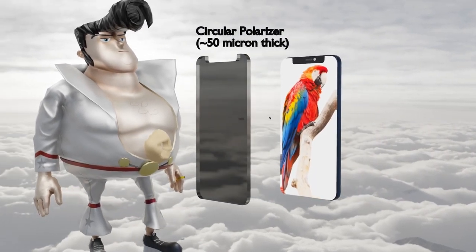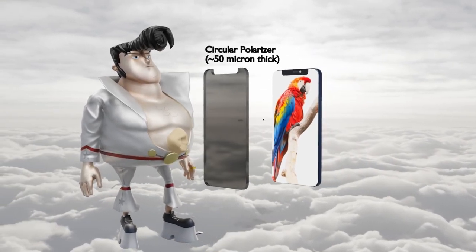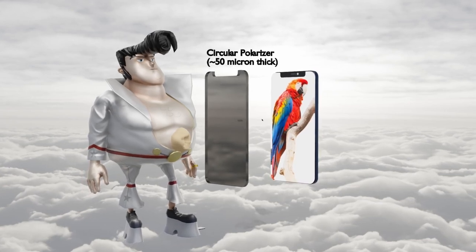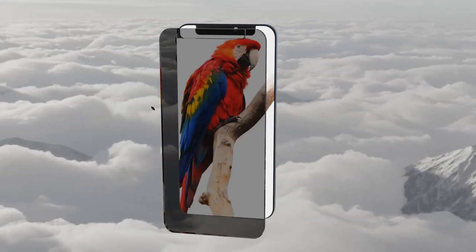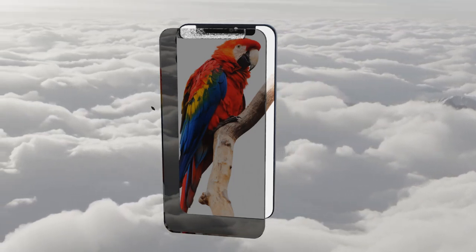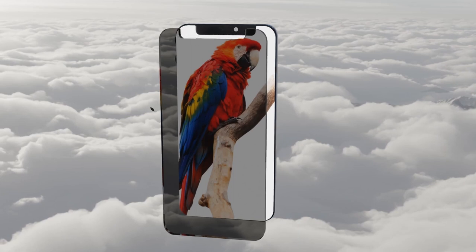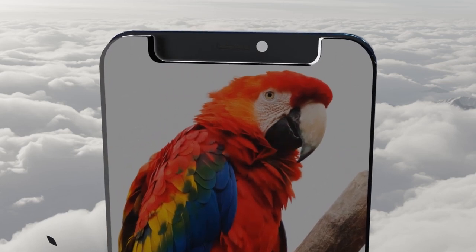There is no big problem for OLED on a glass substrate, but when the display is folded or rolled, the thickness of the circular polarizer is becoming increasingly problematic. Another problem is that the transmittance of a circular polarizer is only 50%, so when taking pictures with a cell phone cam, dark or distorted images are produced. To prevent that, a part of the circular polarizer was cut out so that the camera lens did not interfere with the receiving light. And as a result, it was teased for M-shaped halos.